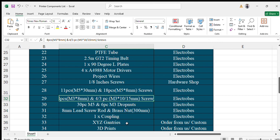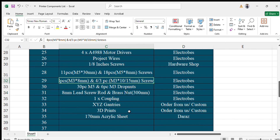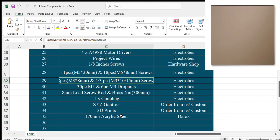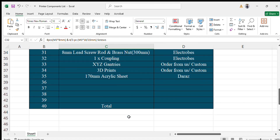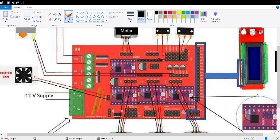After that, X, Y, Z-axis gantries and motor mounts. These are 3D printed parts that are not available in the market; you can contact us on WhatsApp — the number will be in the description — or type in the comment section. Also, a 170 mm acrylic sheet is needed for the bed because a 170 mm heat bed is not available here, so this printer will be without a heat bed. If you want a printer with a heat bed, that would require around a 214 mm bed size, which is available in the market.